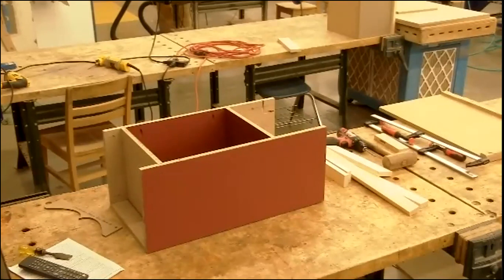So today we're going to get our face frame assembled and mounted to the nightstand. This little guy right here. That's going to involve a process of cutting some pocket holes in the horizontal face frame pieces and locating where we want those to mount on the vertical stiles, and then clamping it into a little jig, getting it assembled, and a few other things like that.